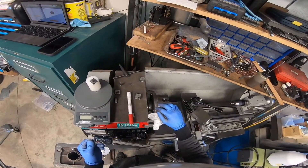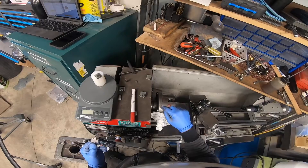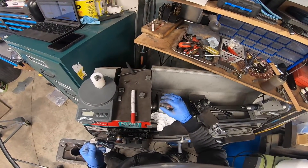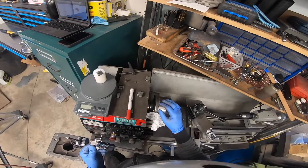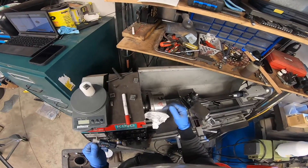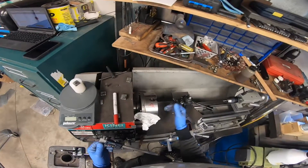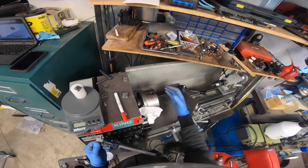You can't just go deeper when you're doing this, because you get diminishing returns. If I drill a half inch hole half an inch deep, that gives me a pretty good weight removal from this area. But if I just keep going deeper, the next half inch isn't going to affect the dynamic balancing in the same way. It will remove the same amount of static weight - 0.4 of an ounce - but when I rotate it, because the mass is closer to the center of axis, it won't have the same effect on balancing.